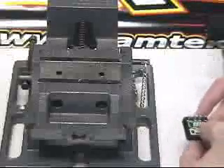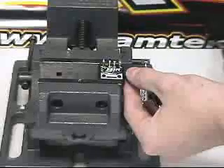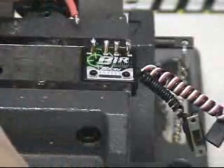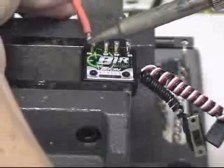For the next step, I recommend using a vise to firmly hold the ESC on the table. It will make a huge difference in solder connection quality and acts as a second set of hands so you're not chasing the ESC around with a hot iron. To solder the wires to the post, heat the post first, heat the wire, then bring them both together and apply more heat from the iron. This will allow the solder to flow easily, it will look better, and the connection will be much stronger.